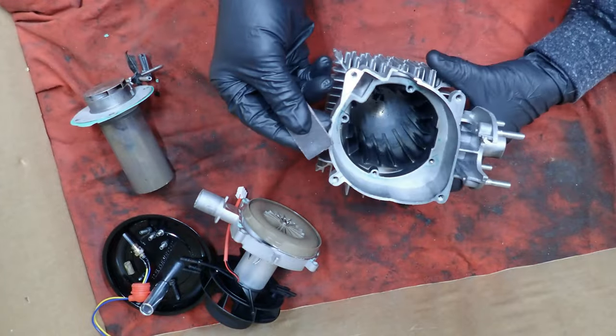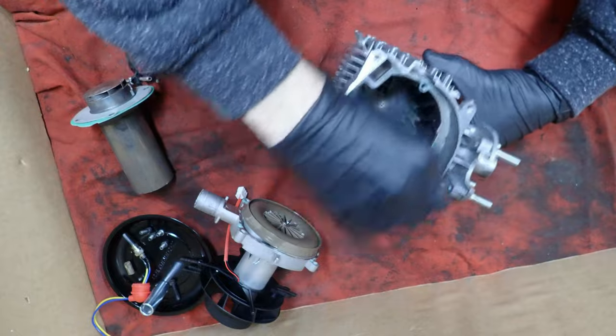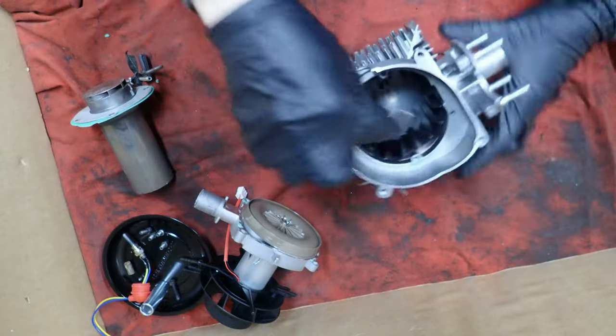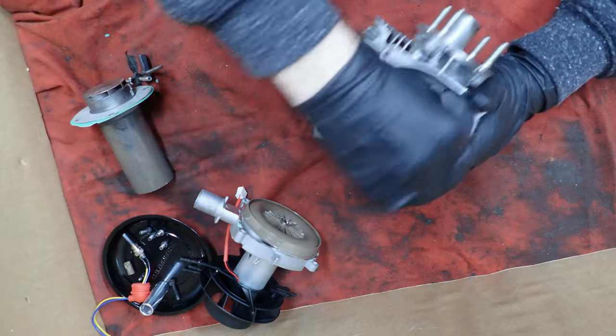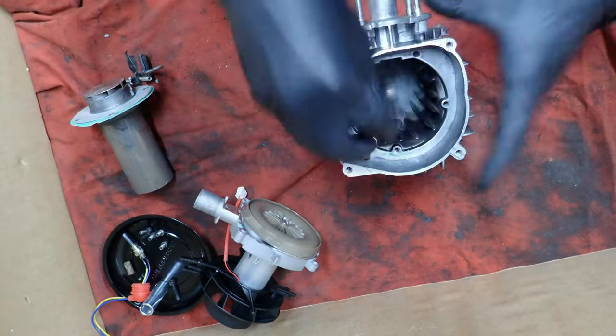This is just emery cloth. It's 120 grit. We're just going to clean where there's excess gasket that got left, just real quick. And then if there's any debris from the gasket, we'll get it out of there. And I'll go ahead and spray this cylinder down